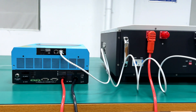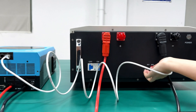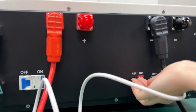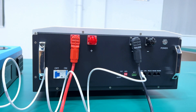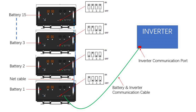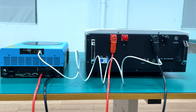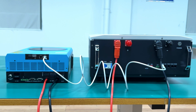For single battery communication with inverter, set the DIP switch of battery to one like this. For multi-battery units in parallel to communicate with inverter, the dial address of each battery is different — please follow our guidance document instead. Also notice to use a network cable to connect each battery via the RS485 port so that the batteries can communicate with each other.